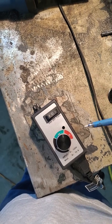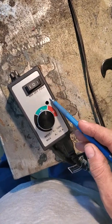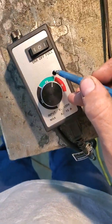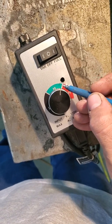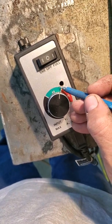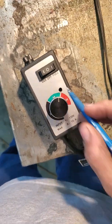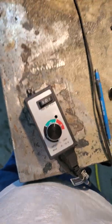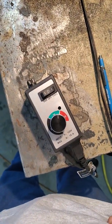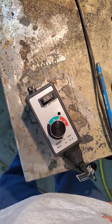Or you can put it back together, see if you like it, take it back apart, put it back together. Or you can just drill a hole in it because the potentiometer is underneath. My hole is off because I didn't know exactly where to drill. On this one it really needed to be drilled about on the corner of the green right there — if I had centered my bit on that I think I would have been basically dead on. But once you drill that hole, you go in with a flat blade screwdriver and you can slow down or speed up to basically make it usable.